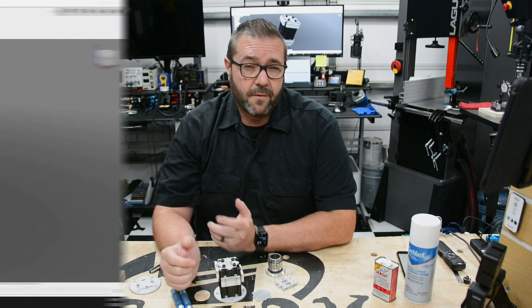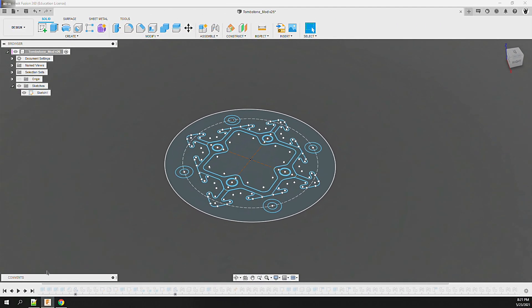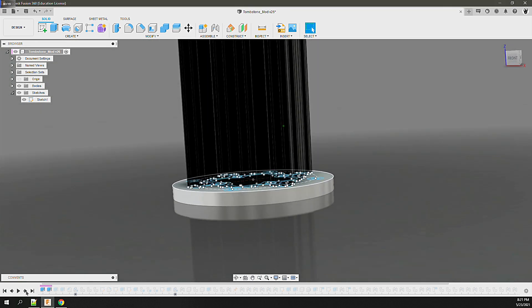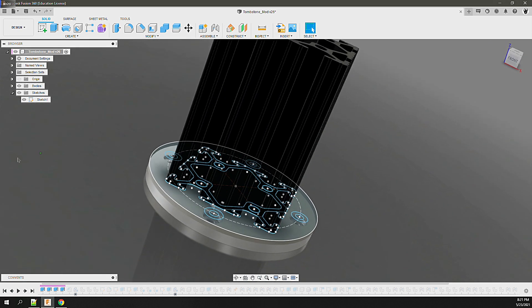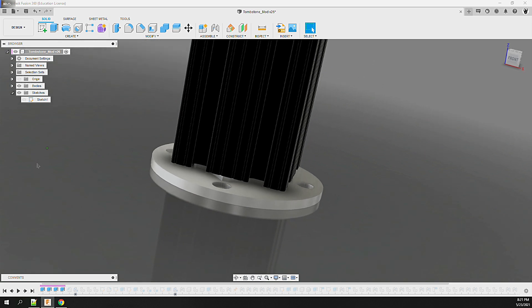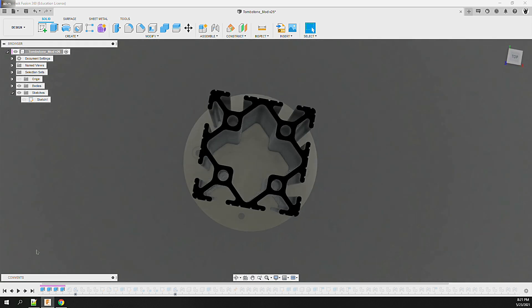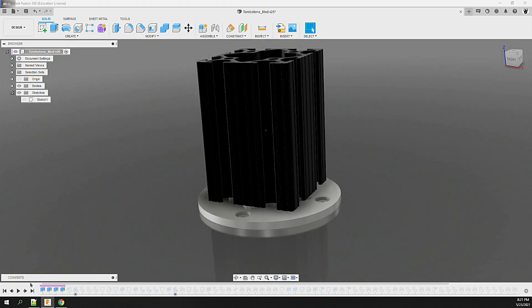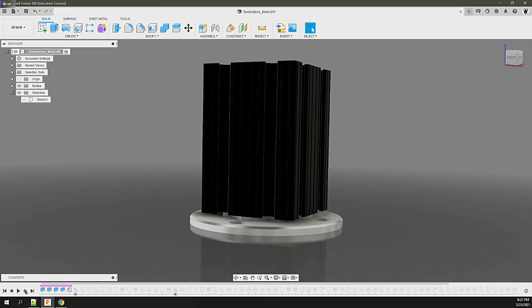So that's what I did. Over in Fusion 360, I started a new design by sketching the base as it would attach to the platform on the Pocket NC. After deciding on the general mount points, I pulled in the profile for the T-slot quad extrusion. From that profile, I added a riser to the base for two reasons: to provide clearance, and to seal the internal cavity so that we can add dampening material later on. My thought is that the hollow cavity may cause noise or resonance, and filling it with epoxy or some other medium may help with that.